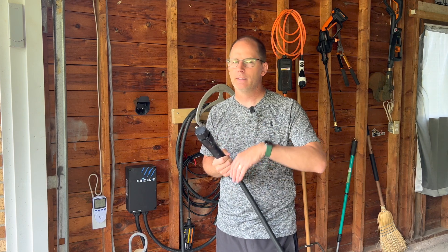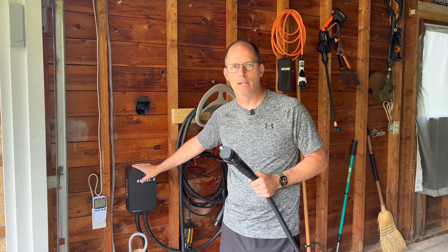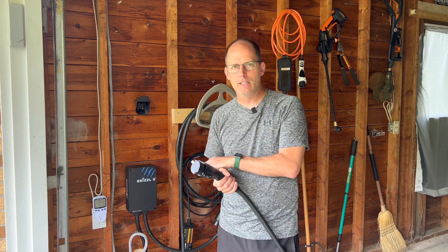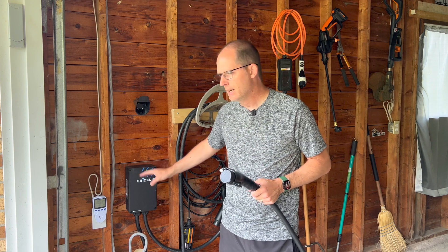For the value shopper, I don't recommend getting a charger with an app — it can add confusing settings. I want a charger where you take it off the wall, plug it in, and it works. Also keep in mind most modern EVs and PHEVs have their own apps that give you charge information. So for value: get one without an app, capable of 40 amps, with a 50 amp circuit. These are far more about convenience than money savings. Installation isn't a massive job — in my house it took about half an hour to an hour to run the wire.